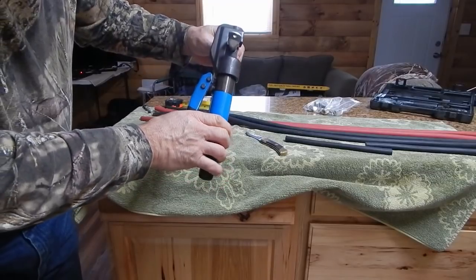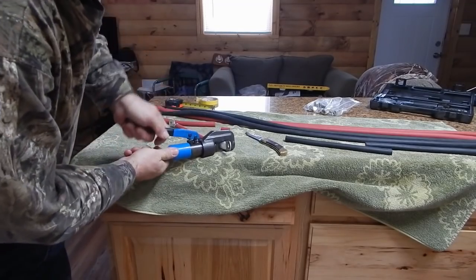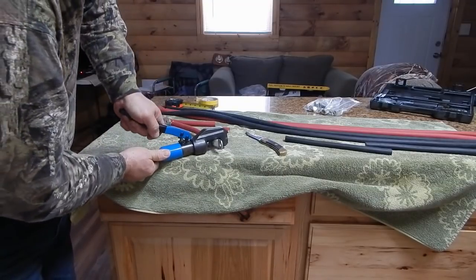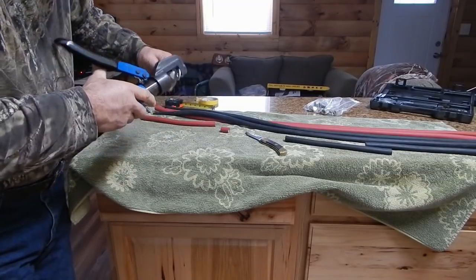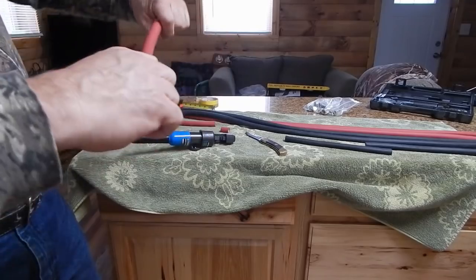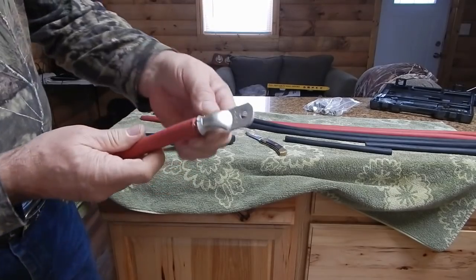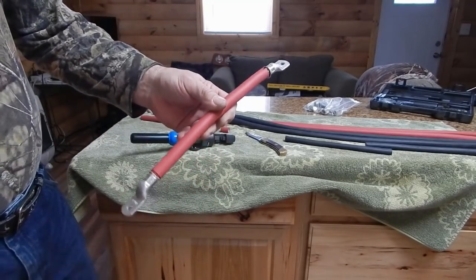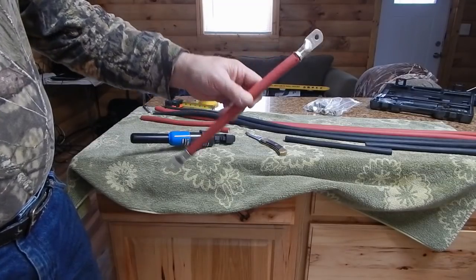And that's what it looks like — you just keep squeezing. I can't see the camera from here. And that's it. I have a manual crimper also, but I like the hydraulic one better. When you crimp them, it makes the cable really stiff, especially on the ends — that's when you know you've got a good crimp. That's what you want your crimp to look like. You don't want to have big wings sticking out — that means the die was too small. So I've got one more of these, two blacks, and then two 4-foot blacks, two 4-foot reds.